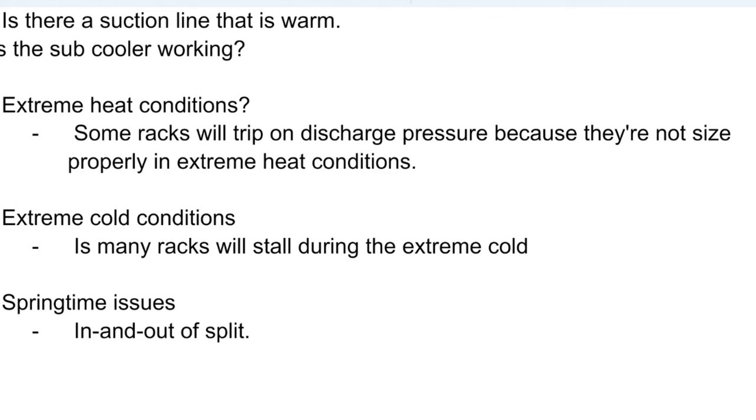causing the refrigerant to flow down into the cases. Or if you can heat up the refrigerant somehow, like I've seen guys bring the tanks into the store and put them in a bucket of hot water, let them sit for a little bit. Some guys I worked with had trucks with climate control where their tanks were. That wasn't common, but it was a passenger vehicle retrofit to be a tool vehicle, like a service van, so it actually had the AC in the back. They would turn on the heat in the back while their tanks were secure, Department of Transportation safety and all that, and it would raise the temperature of the tanks to like 50, 60 degrees. Now you have 50 to 60 degree refrigerant going into your system with all that heat energy, rather than -5 degree refrigerant sitting up at your condenser.